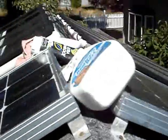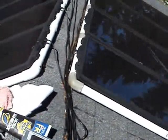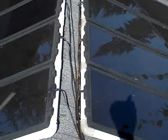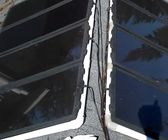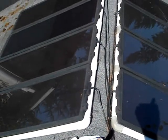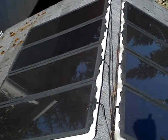These panels — you probably see me point the camera at this little building — the roof has these other panels on it. There are two SM55 Siemens monocrystalline panels, and there are sets of the Sunforce amorphous 15-watt panels, four in each set. Each set is connected to the 7-amp charge regulator, along with the Harbor Freight panels on the ground. So these three amorphous panel sets are connected to the 7-amp regulators.